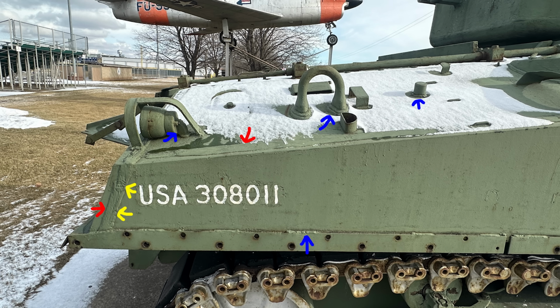The blue, as far as I could tell, were all stick welds, so some form of faster freezing rod. Again, remember the early to mid 40s, stick rod technology isn't what it is today. Basically, low hydrogen 7018 rods were a military secret in World War II, and definitely were not at the quality of what you can pick up today at your local Tractor Supply Co. So overall, these didn't really look that bad for the most part, given the time frame too.